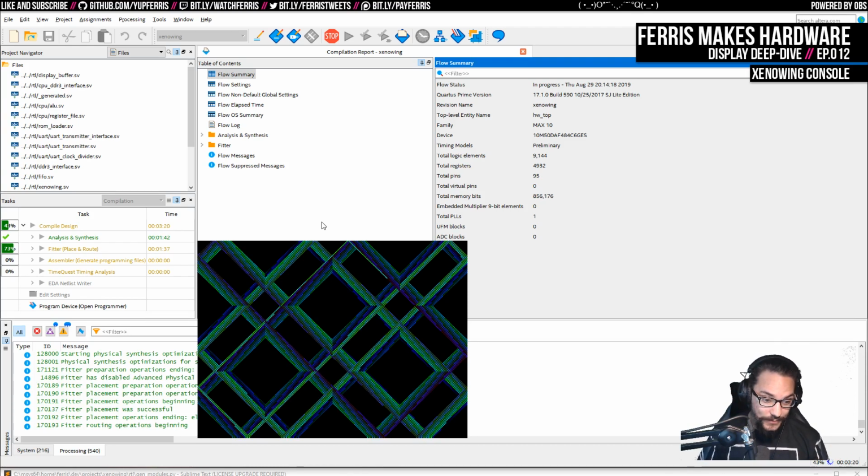And the coolest part about this approach too, one of the nice things about this shared memory architecture, is that I can prototype all of that in software and then start seeing, okay, what does my rasterizer actually look like? What does our setup need to look like? I've also been thinking about the way we want to do vertex transformations. And again, I'm thinking to do this 16 by 16 bit fixed point everywhere.